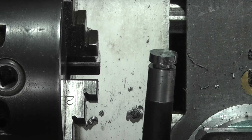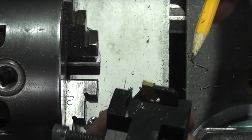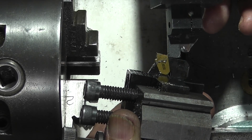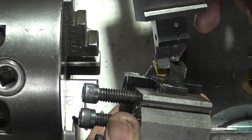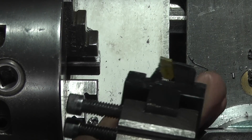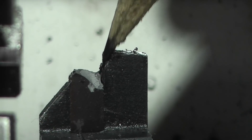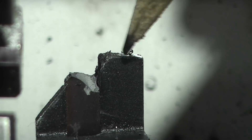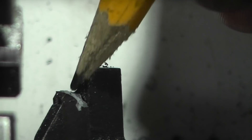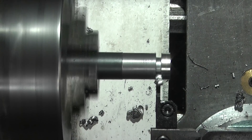So I'll try this new holder and see if I get that problem. I shouldn't, because the new holder has more support under the tool compared to the other tool — you'll see the difference in the support, it's probably twice as much. Any force on the tool is forcing it at a 45 degree angle, trying to force the tool back into the holder, so I'm hoping this will last longer. Now if you look closely where the tip was, it's rounded off the edge. When this tip broke, the majority came downwards and rounds off the edge of your tool holder, so the next time you put a tip in there is less surface to hold it and they just keep breaking. I was running that at the same speed, same width of tool, set up square within a couple of thou.